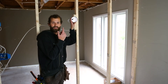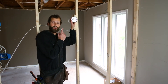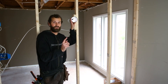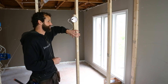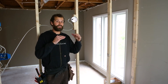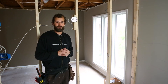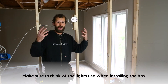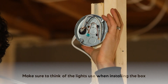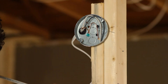Some of the concepts behind locating this vanity light include the final lighting selection on the part of the homeowner — what type of light and what location is therefore required. If the sconce has a downturn to it and this light is located for the lady of the house, this is probably a good elevation for the final fixture, because for the purposes of applying makeup and addressing yourself in the morning, you want that illumination to be at your face level or close to it so you don't have shadowing. This location was selected in conjunction between the homeowner and the designer, and we followed the plans.